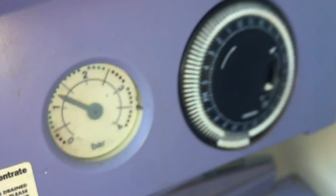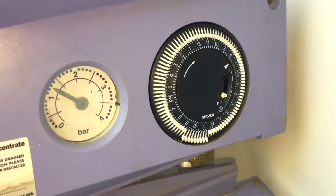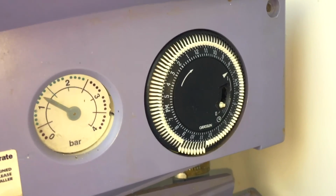Okay, so about 1.25 bars. I'll run it, I'll get the air out of it, it should settle at a bar. I don't generally run boilers unless they're brand new at 1.5 bars ever, especially not in the Performas like this. Don't want to start a leak on that pump, they often leak their O-rings at the back. So yeah, play it safe.